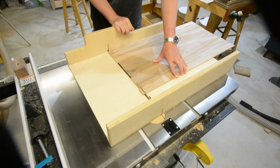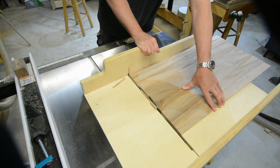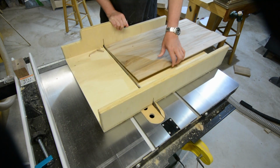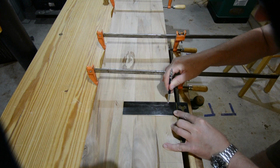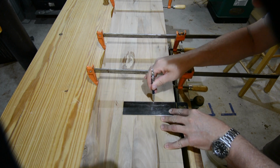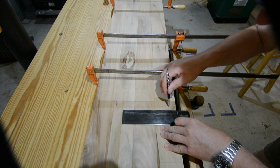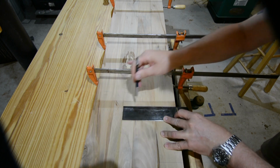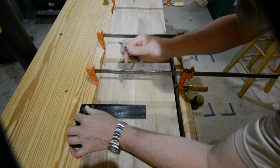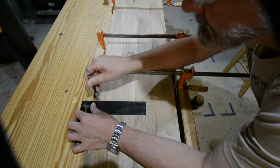When the panels were fully glued up and dry, I used the crosscut sled to true them up. Trying to be really accurate, I clamp all of the styles together, make sure they're absolutely lined up exactly right, and then mark the locations for the dados for the drawer webs to go into, so that they're all in theory in the exact same position.